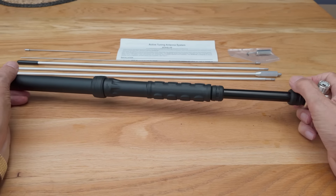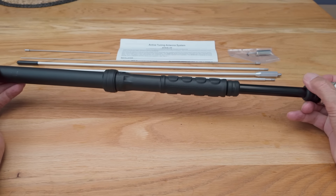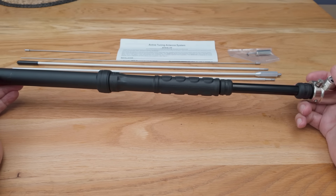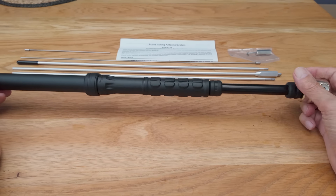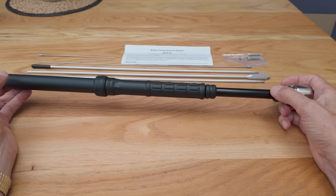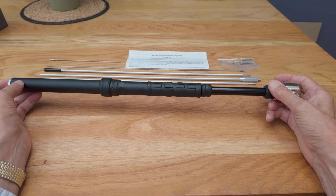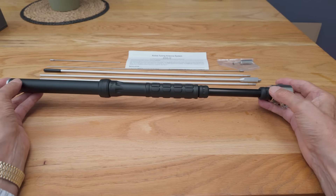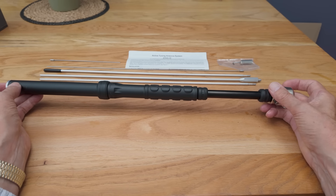How does it work on VHF? With the antenna coil completely collapsed, this is actually a quarter wave on two meters — the coil is out of circuit, it's bypassed. Plug the radial in and you get basically a two meter vertical. On 70 centimeters, a two meter quarter wave is three-quarter waves on 70cm, so this is actually three-quarter waves on 70cm, which gives a low-ish impedance at the base. Plug in the 70cm radial and you've got resonance on that band. In fact, with both radials plugged in you don't need to change anything at all — you've got resonance on both two meters and 70cm.